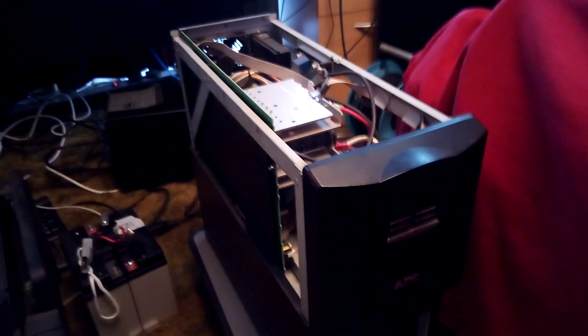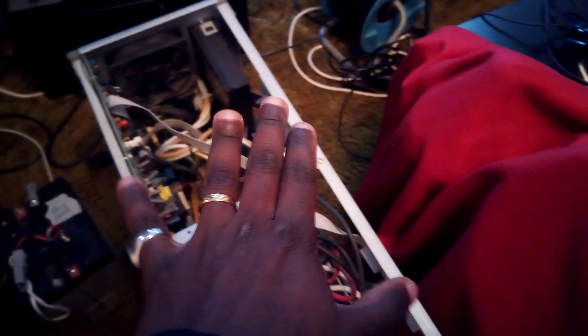If you're still not a hundred percent sure about the battery configuration, open up the top just as I've done here. I'm going to put it on its side so I can show you the two modules on the inside. There you will see either 12-volt or 24-volt — in this case I've got two 24-volt modules. That tells you definitively that this UPS is using a 24-volt system.